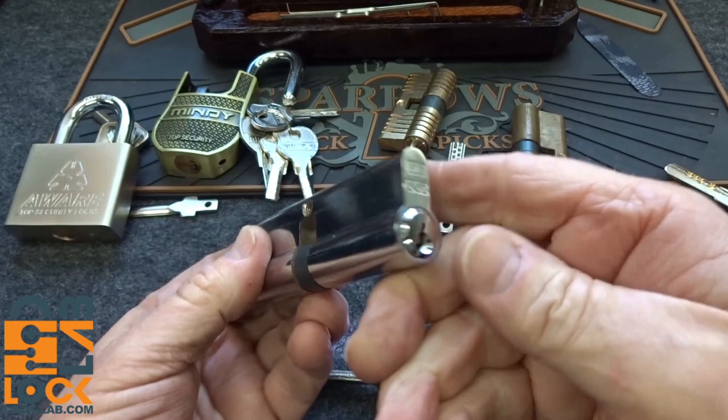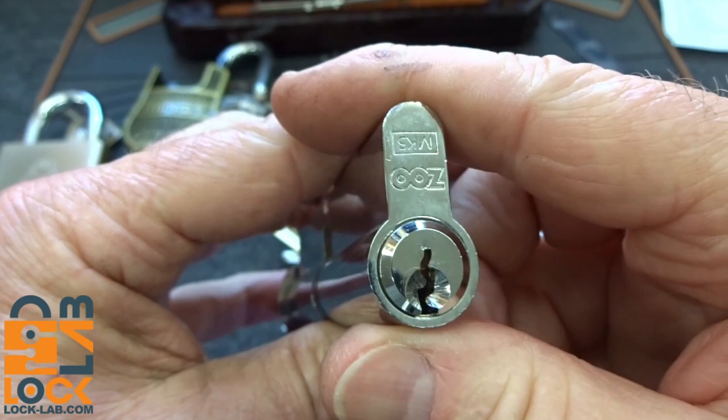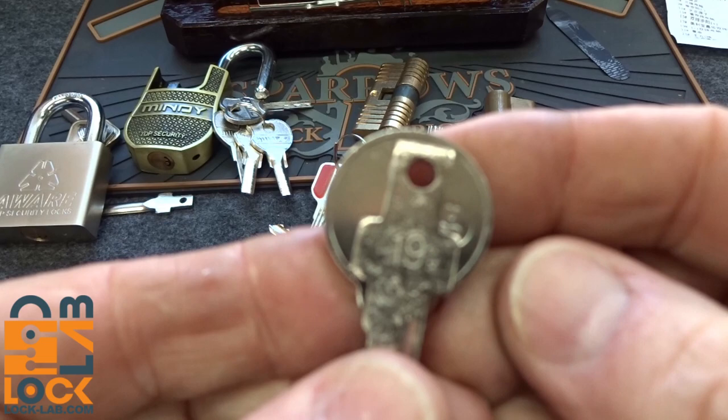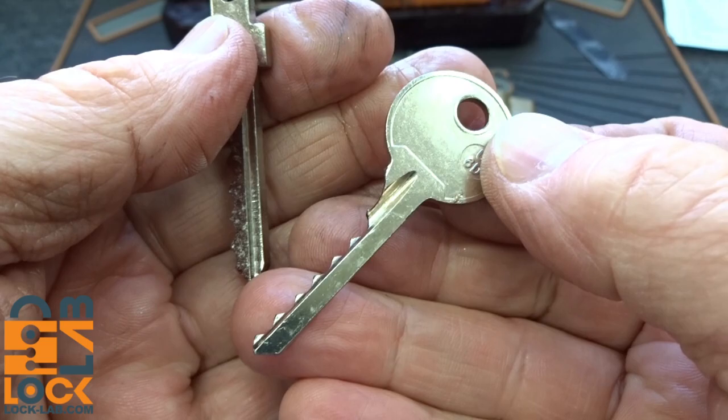The only one I got open was the Mindy. I don't really have a lot of these kinds of locks — normally I face a normal keyway. Unfortunately, even though we've got a huge pile of these bits, none of them fit a pin tumbler lock that we normally see. So how would we get in there? Well, I do have bump keys, and here's one that does fit this keyway. But it won't fit into the gun. So what I'm going to do is sacrifice this bump key as an experiment — I can probably cut this pattern out, draw on it, cut the same pattern so it'll fit into the gun. Then we'll have a normal bump key and see if I can't get that to work.